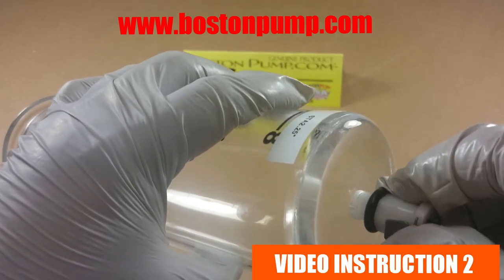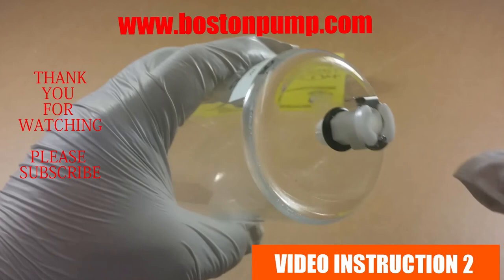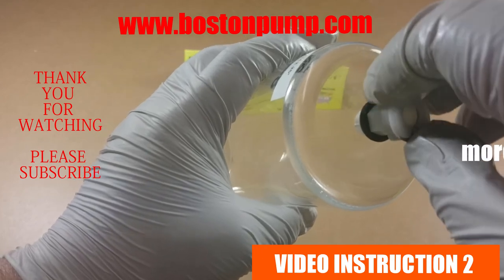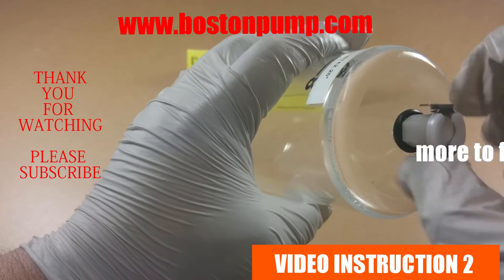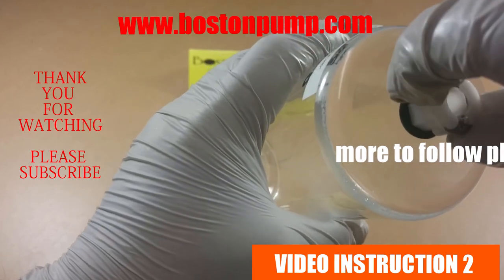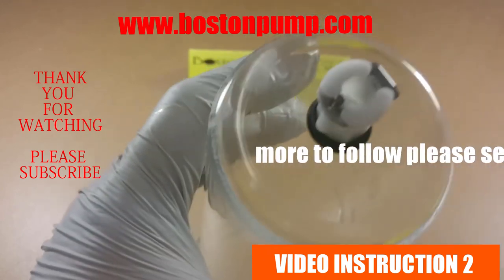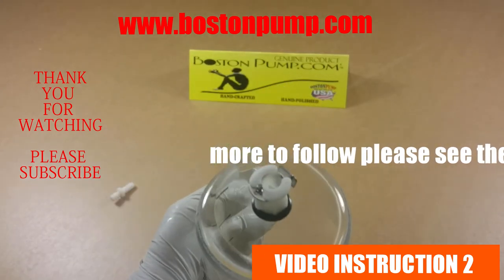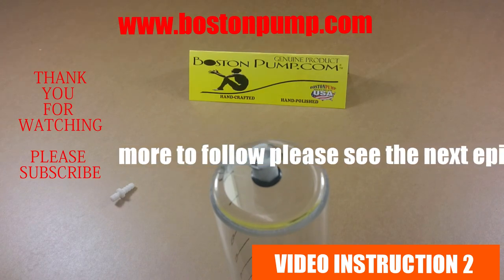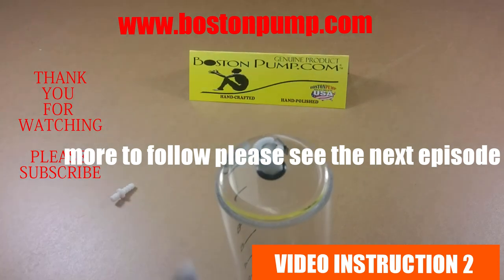With the coupling lubricated, first make sure you find the right starting position so the threads aren't cross-threaded. Turn it to connect, making sure it's all hooked in, then turn one full turn as your start turn. From that point, using the metal piece on top as a reference, go four turns: one, two, three, four. At four turns you already have a good connection. You can go to ten, fifteen, or maximum twenty minutes past that point. Do not over-tighten. Many customers call saying their brand-new equipment is leaking — the reason is either the coupling is too loose or over-tightened. Please follow this procedure.